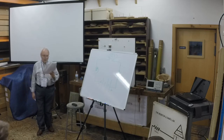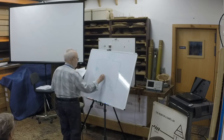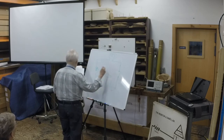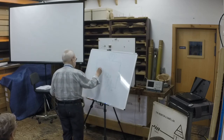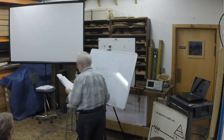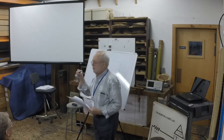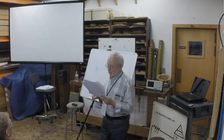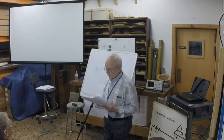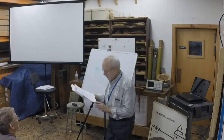So he draws you a little picture and scribbles in some numbers. Right. Here's the same picture. 12 volts for the battery, 200 ohms for the resistor. Right. So how big is this light bulb, sir? Oh, it's a metric or no. How much current does it take? Well, I don't know, but it says 12V 60MA on it. Fabulous. The guy's off and running.